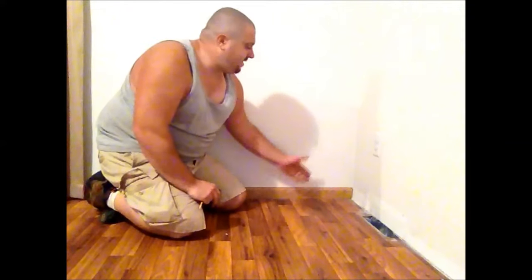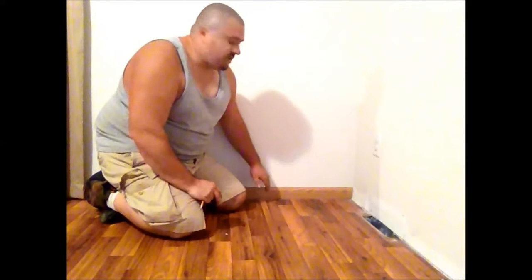Register removed and the molding along the back wall, we're going to measure down the side walls. Now we know the bottom, we're going to have the bookshelf be 16 inches deep, so we can take 16 inches off, plus we're going to use 3/4 inch stock on the front to put veneer on the front of the pieces of oak plywood. So we're going to take 16 3/4 inches off of the molding on the floor on both sides of this bookcase. Let me get it done.